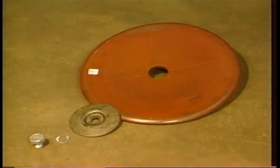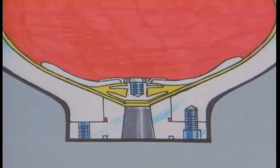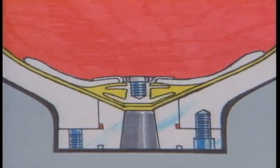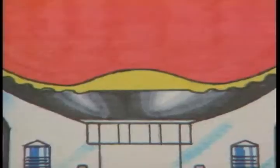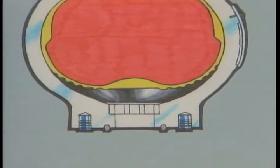The diaphragm of the Hydral dampener contains a diaphragm stabilizer. It attaches to the metal insert. As the insert approaches a seating position, the stabilizer stiffens the diaphragm. This assures the uniform flexing needed to control highly viscous drilling mud. The Continental unit doesn't have a stabilizer. As mentioned earlier, its diaphragm has a little thicker wall design, and this assures the uniform flexing.